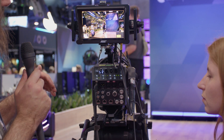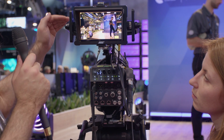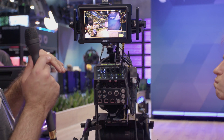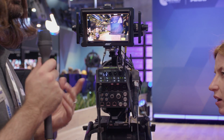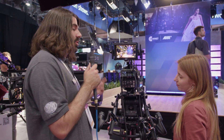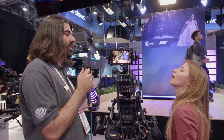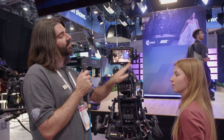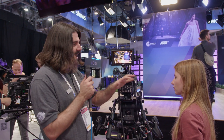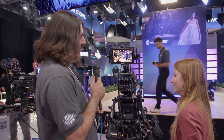We've added a lot of interesting features too. Customers asked: beyond just having return video, can we have multiple return videos? We need to see multiple pictures from different sources. So we have four return videos that you can switch between, which is really fantastic. Return video is — let's say you're making a production and you want to see what's going out live to air. The return video is the video coming back up to the operator: maybe what other camera positions are doing, maybe the live feed without graphic overlays for sports, and one that has the graphic overlays. If you talk to the sports guys especially, they say they've got to have four return videos. So we put four in there.